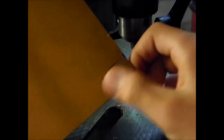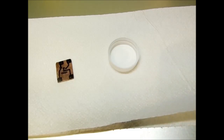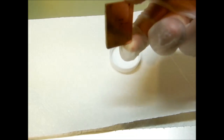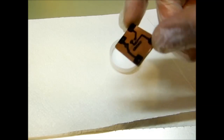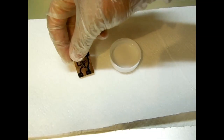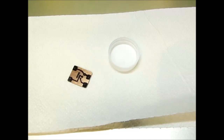I have all the holes drilled out. I have drawn out the places where I do not want the copper to be etched away — that's where all the traces are going to be. And I have cut the board out of the main board.